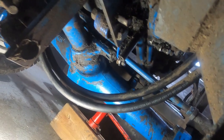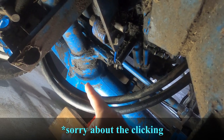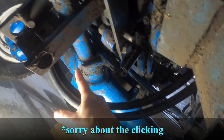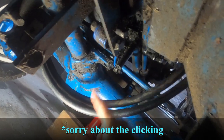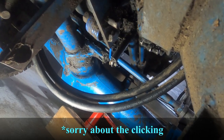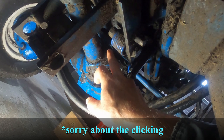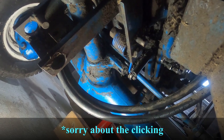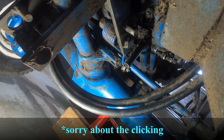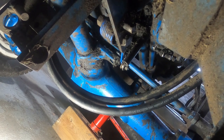So sit back, relax, and let's see how I can fumble my way through this. The axle's basically two trunnions. The back one being hollow that the drive shaft goes through. There's two bolts on either side of the back trunnion, and there's another trunnion on the front with two bolts there. There's dowel pins that line everything up. There's a little spot right here where you can get a pry bar in and you just slowly work it down. Putting it back together, you've got to be really careful - get everything all aligned, tightened up evenly so it goes all back and square.